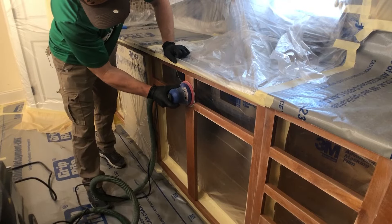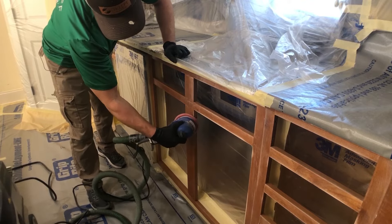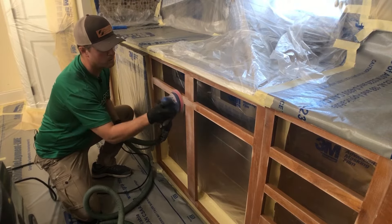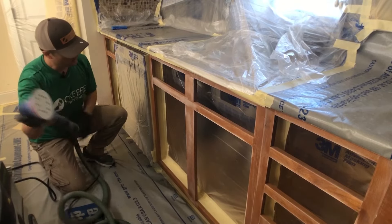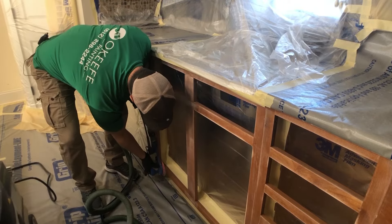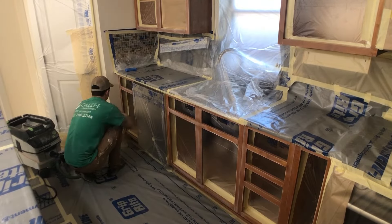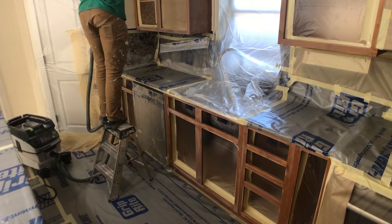With the sander, put it on the surface before you engage it and keep it level — don't tilt it and round out the edges. It's with the three-by-four sander that you're going to burn through this edge; with the five-inch sander you don't want to do that because you can create little valleys. Near the plastic, I'm not going to worry about hitting this area — I'd rather have the other sander or a sponge handle this edge. After the scuff-sand is finished, hook up the brush attachment to the Festool and vacuum the surface, focusing on that bottom edge and the floor in the cabinet, so you don't have any debris flying up into your finish.